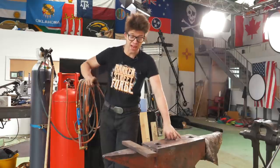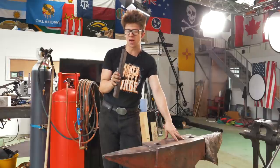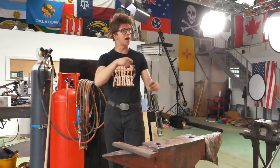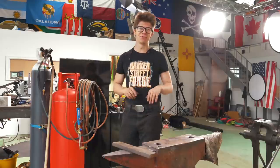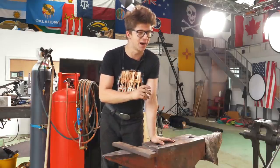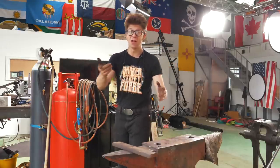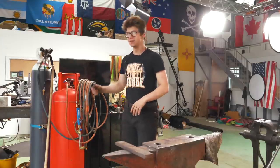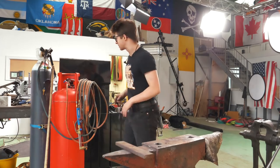I'm gonna take this piece of flat stock — I'd say three by three quarters of an inch — and I don't have a slot punch for the power hammer here. I think I left one at the old workshop. I'm gonna do something I've never done before and would have never let myself do in the past: I'm gonna torch a slot in there and then hot drift it open. Hopefully this works well — it's a quick and dirty way when you don't have the tooling and you don't want to make the tooling just yet.